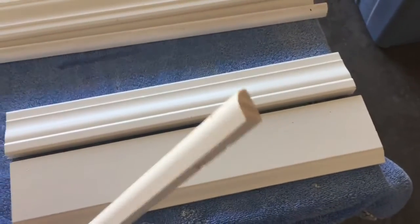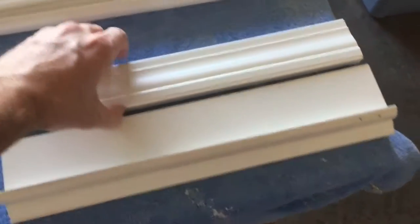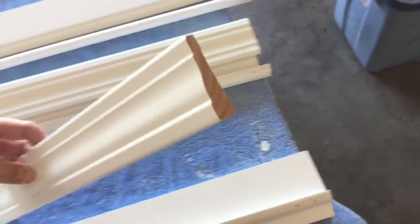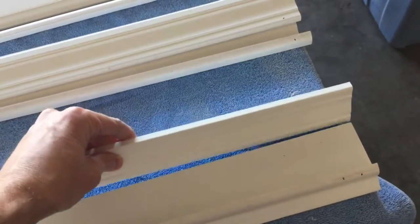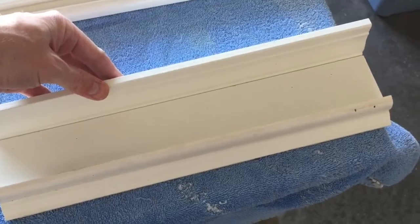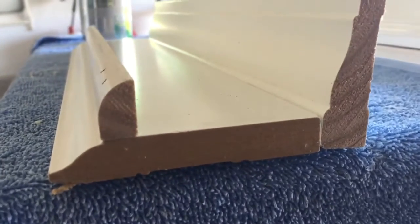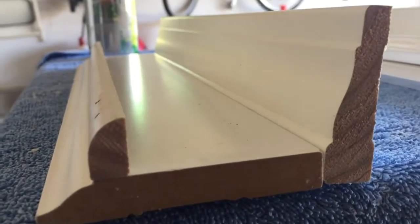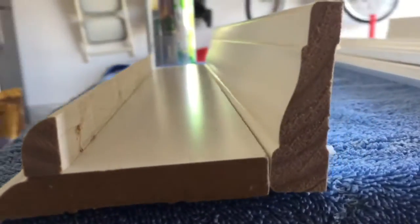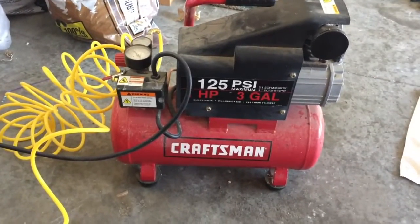Okay. So once you have all your cuts made, this is how it goes together. The quarter round will sit atop the baseboard piece, and then the door frame molding will serve as the back. This quarter round piece will be the ledge against which the books that you put will stop. And this is an important piece, right? You don't want the books that you put on there to be sliding forward when you prop them up against the wall. So that's how it fits together.